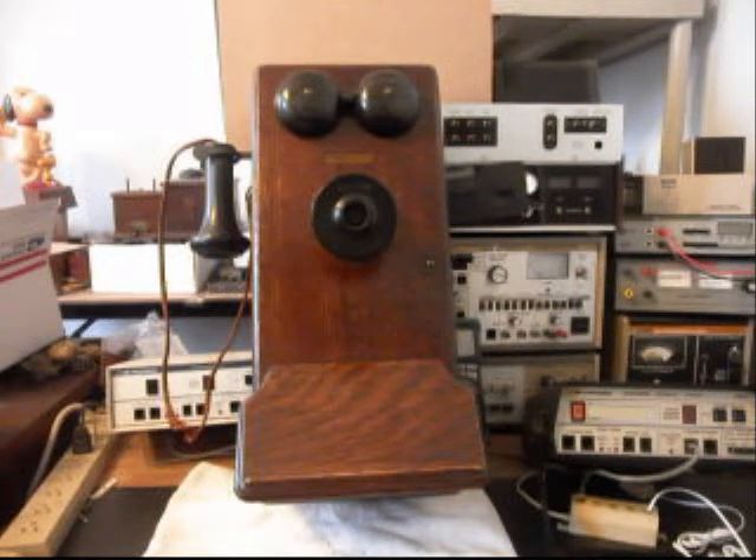He has a note here with the telephone and it says convert for modern use as an extension telephone. So what we want to do — this is the initial checkout — we want to troubleshoot the receive, the transmit. We know the bells are ringing when you crank the crank, but we also need to install a circuit that allows you to walk up to this telephone and crank the magneto and ring the bells but not back feed any voltage into the telephone line, so that when you get a call the telephone will also ring.